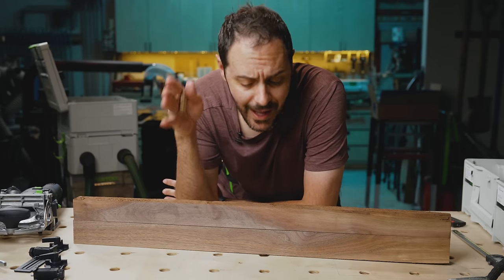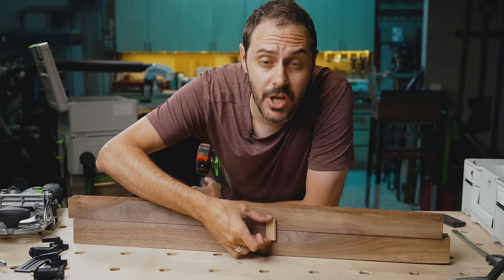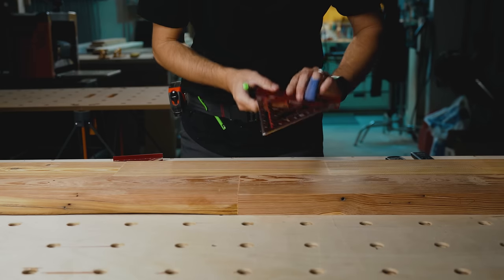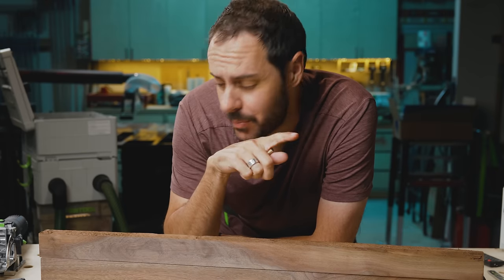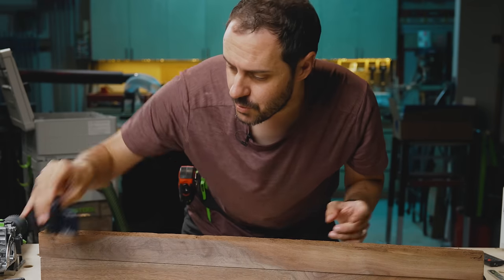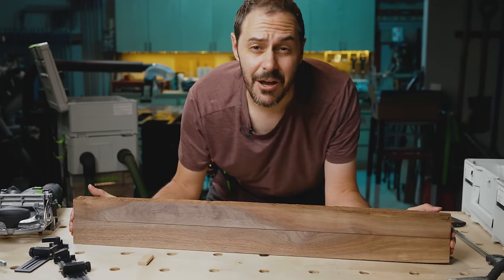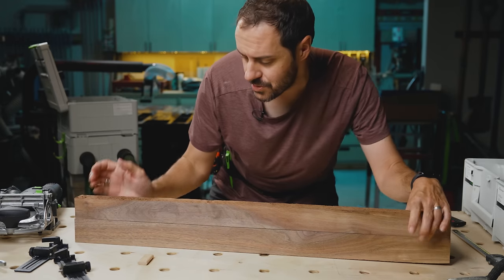The one time I previously used the Domino was gluing up a panel just like this, putting Dominos in these joints. I've done this with biscuits before — which is kind of pointless. You can use dowels, or just use glue. But before, I marked and measured all my mortises and lined them up by eye on tight, and I got it — before I knew about the 37mm pin locations and the cross stops. Now I'm going to set the cross stops to 150mm — roughly six inches — and try to mortise and join two pieces of rough walnut. I'll do the first on tight and then all others on loose, using the cross stops.